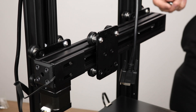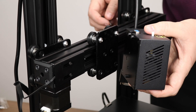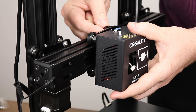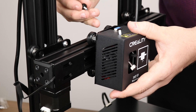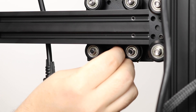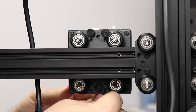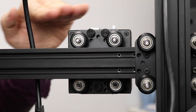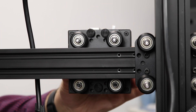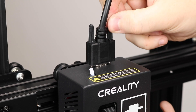Let's begin by setting up the printer in a 3D printing configuration. Each tool head that comes with the printer has three holes — two on the top and one on the bottom. These holes align with holes in the X-axis gantry plate. Take your time, line the holes up, and then put your first securing screw in. You can leave final tightening until all the screws are in. Check the alignment of the tool head to make sure it's square with the X-axis gantry plate, then go around and ensure that all the screws are tightened to satisfaction. The tool head should not move or wobble at all. Creality has chosen to use a VGA-style connector for all tool heads — simply plug this in and screw it down.